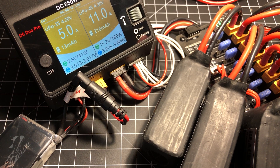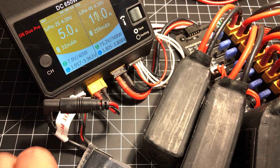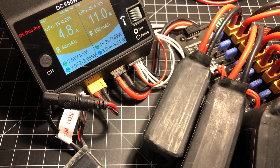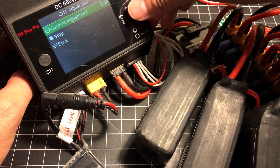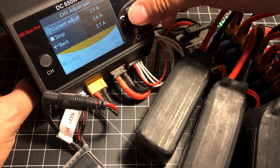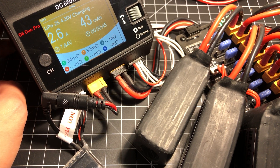With a 12-volt power supply, you can probably expect no more than about 11–12 amps on each channel. To get the most performance out of this thing, you need a 24-volt supply. But as you can see, it is absolutely usable. You can probably hear that fan a little bit — there's a big fan in the back for cooling. A nice feature is that mid-charge, you can just select the wheel and lower the current live while charging, without stopping. It just drops right to 2.6 amps.